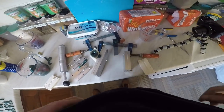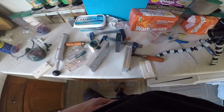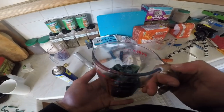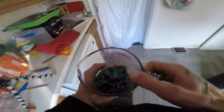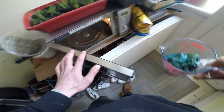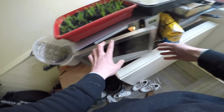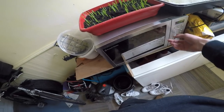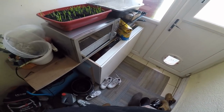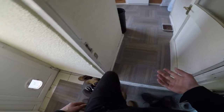Right, so I'll clean all this up, get set up, and mold some lures. Here's the plastic in its hard form. What I'll do now is stick it in the microwave for about a minute and a half to start the process of melting it down — it's got to get to about 350 degrees before it goes liquidy.